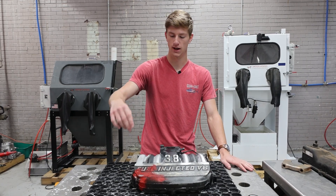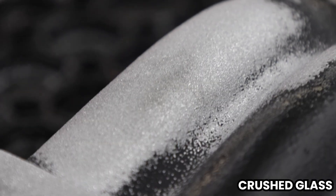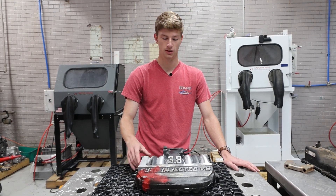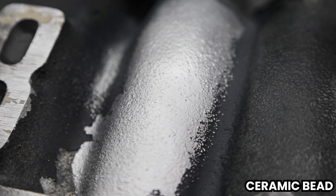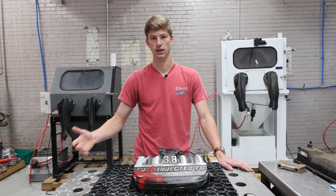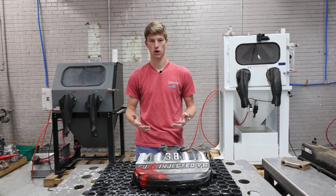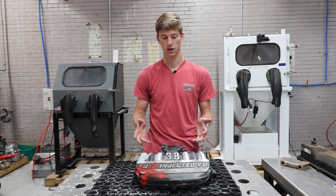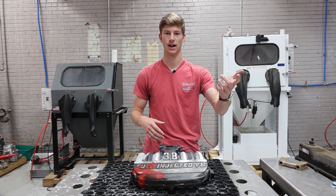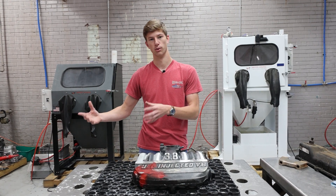From left to right you've got: crushed glass, aluminum oxide and glass bead mixture, ceramic bead, and glass bead. The polish and finish quality definitely go up across that progression. The crushed glass gave a super rough finish — you can see the shimmering where the surface has been roughened. The mixture is duller than the ceramic and glass bead, which are both spherical abrasives. The time to achieve each finish is also very different — glass bead took much longer to remove paint. Personally, I would start with crushed glass or pure aluminum oxide to quickly remove the paint, then finish in a glass bead machine — and we'll show that process in the next video.